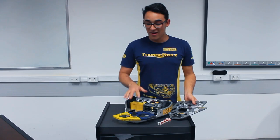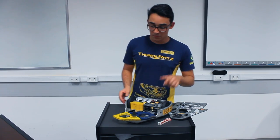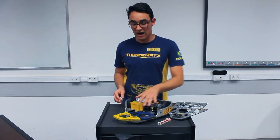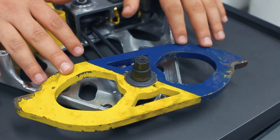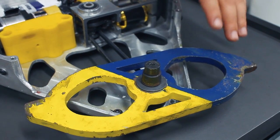Cachorro-Loco has an impact bar of about 1 kg, which spins at 6,000 RPM. The weapon and the axle are made of 4340 steel, treated to 45 and 43 Rockwell-C hardness.